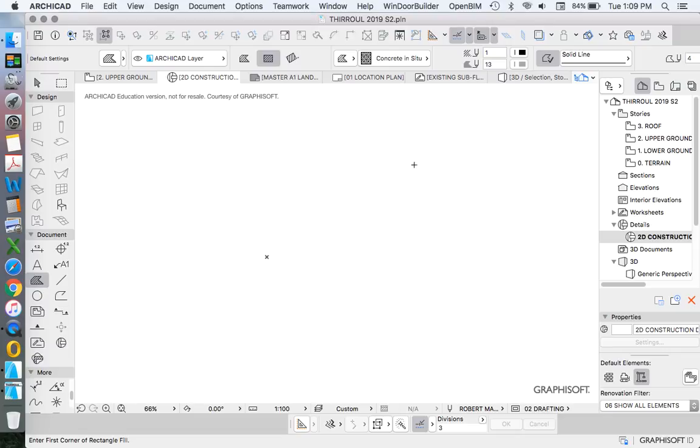So once you've got all of that fill information, press OK. And then we're going to draw a fill. Now, like I said before, my preferred method for drawing these sorts of boxes is using the rotated rectangular method, which means we'll draw in one direction and then we'll come back in the other. So I'm going to draw a footing, and we're going to make this footing, zoom in a bit, 400, so we'll type in D, 400, enter, and we'll go down and type in 400 again.